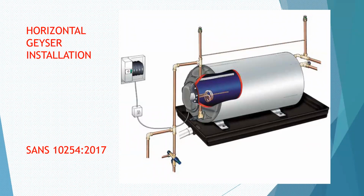So an inexperienced guy is going to get in the roof. He's going to replace the valve. He's going to go back. Somebody from the office is going to phone him and say to him, Mrs. Jones phoned again. The valve is, or the water is running again. So 2 or 3 times like that, whole day wasted, a lot of money wasted and time. So by using your gauge, you are going to save money for the company and also time. Time you could have spent with other calls that you went to. So in that manner, we can use a pressure gauge.